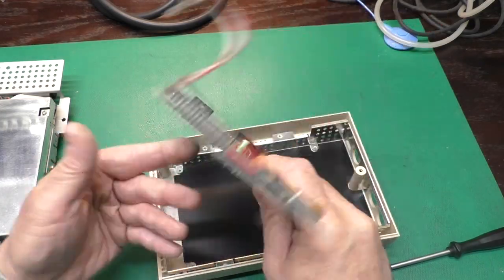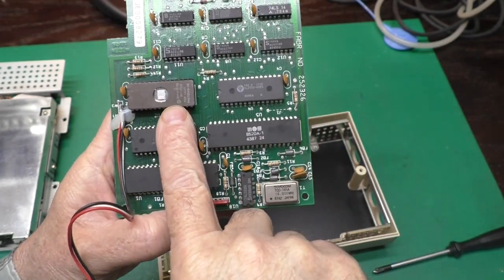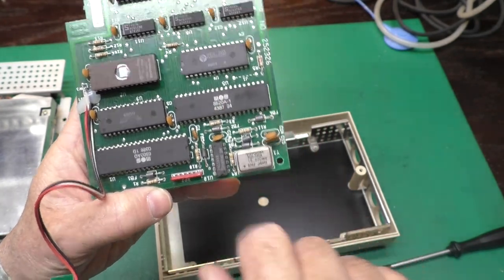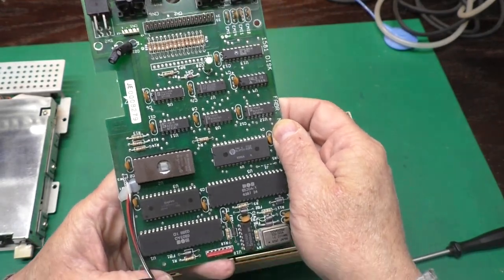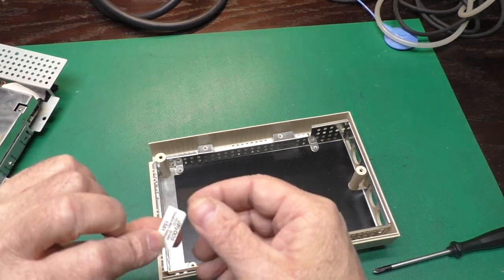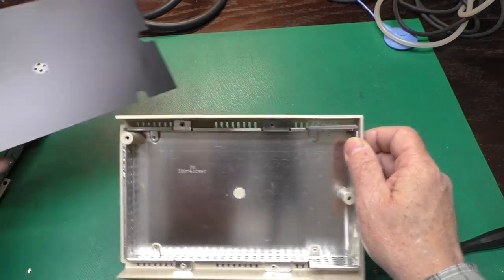Artwork number 252327. On this board we have the Western Digital floppy drive controller, some glue logic, and the EPROM for JiffyDOS where the standard Commodore ROM would be. Some RAM, a 6502, an 8520A CIA chip, and a crystal oscillator. Not much to this really — a lot simpler board than what was in the 1540, because a lot of functionality is built into the drive electronics itself. I've got some thin double-sided tape to stick that sticker back down.